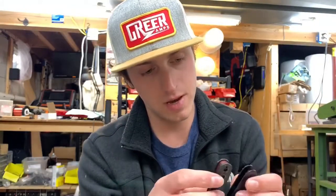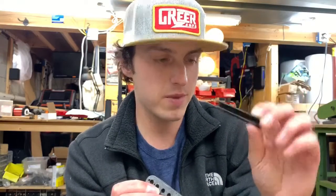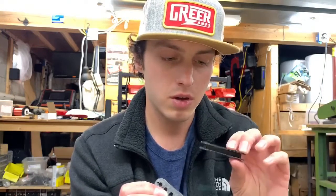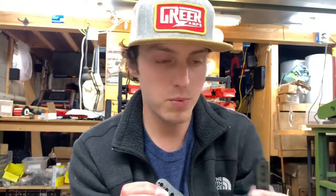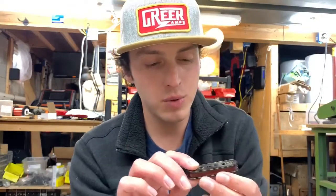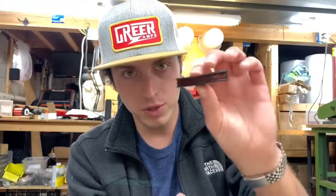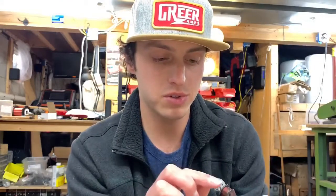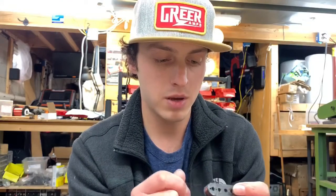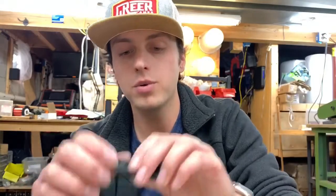Looking a little closer, we had bobbins, which is cool. On the slug bobbin, unfortunately, all the wire was already peeled off of it, but it is in pretty good shape and it is original — so we'll just have to rewind that. On the screw bobbin, it's in a little bit worse shape; you can see it's kind of flanged out a little bit. But it does have that beautiful original plain-enamel coil wire on it. Unfortunately, it is missing the original start lead, which is a problem. On a PAF, the start lead comes out of the bottom of the pickup, and this must have got yanked out or something.